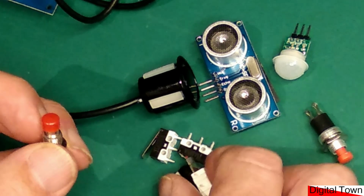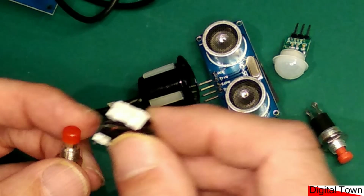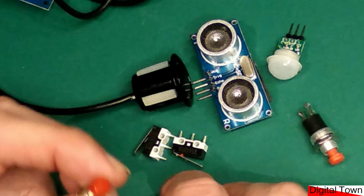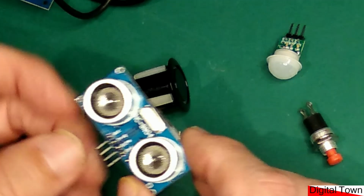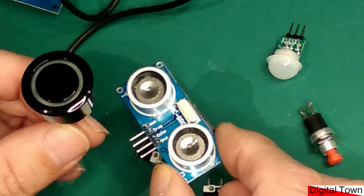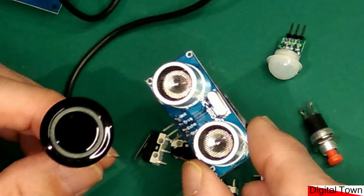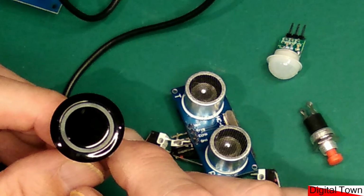So for instance, these limit switches, they are commonly used, but they're indoors. I'm not sure how that would survive in an outdoors environment with muck and water getting thrown all over it. It's the same with this ultrasonic sensor. Nothing wrong with an ultrasonic distance sensor, but this ultrasonic distance sensor has exactly the same sort of features as the one that we tend to know. This was the HC SR04, but this one is more like the type that you see in the back of cars in their sort of reversing sensors.